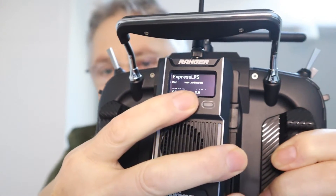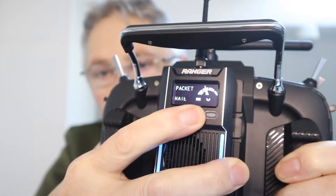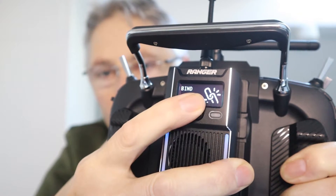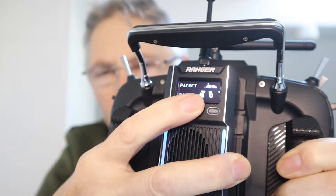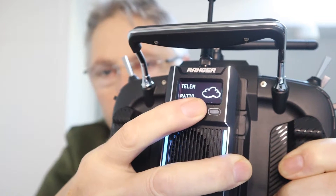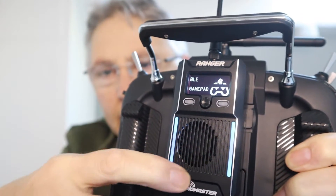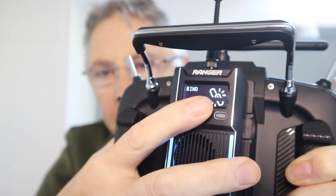I'm going to do this a bit tricky because I'm doing it backwards. If I hold that button down, you can see we can change all the settings. On the motion setting, that would actually turn the transmitter down — if you were on full power, it puts it to the lowest setting if you put your radio down. We've also got buttons here that we can program. This is where the fan is, and I'm only on 25 milliwatts so the fan isn't coming on.